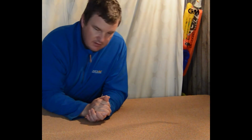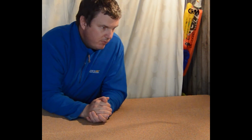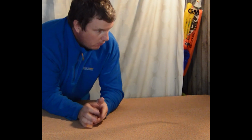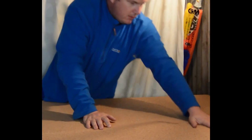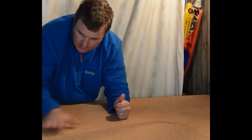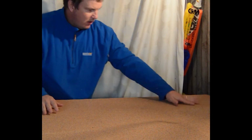So, welcome back. I think you'd have to say that that's not looking too bad at all. A couple of things to point out. It sticks pretty quick. When you spray it on and you get your cork down onto it, so I'm just tapping down a few bits I can see that are raised. You've probably got about 10 to 15 seconds, I'd say, before it becomes difficult to move. It does still slide a bit.